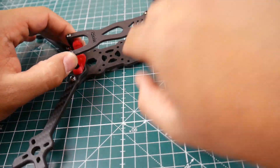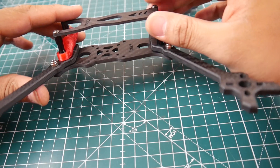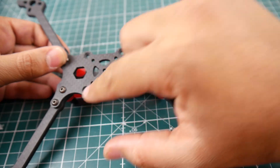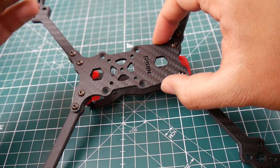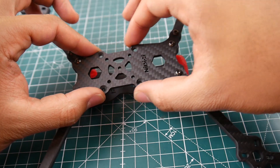Overall you have 25 millimeters of space inside, so it's somewhat of a low-rider-ish build. You'll probably be able to barely fit a three-stack or a two-stack. And if you haven't already noticed, it does take 30x30 and 20x20 flight controller stacks.